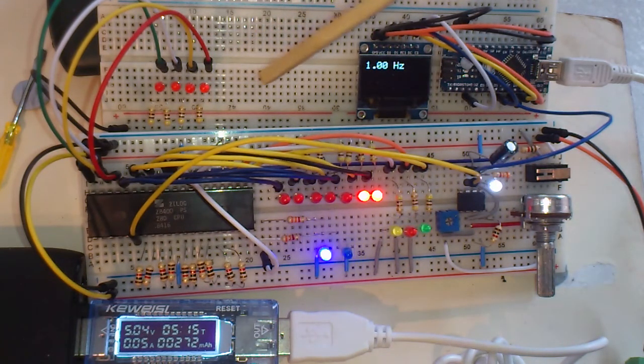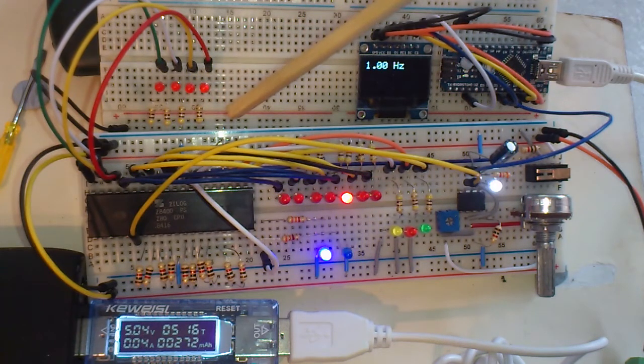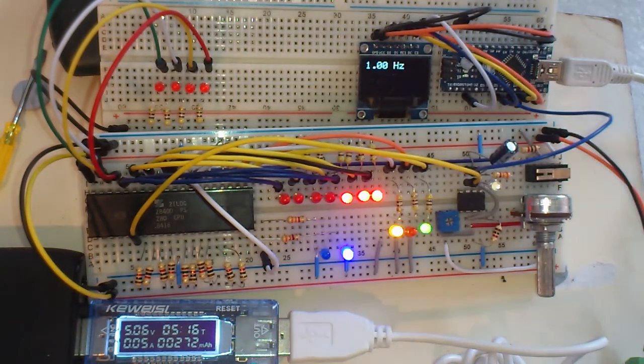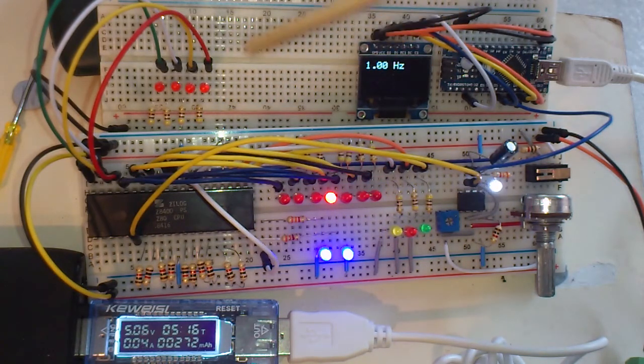The 5 external request pins. Yeah, there's the reset, the wait pin. So some external devices will want the CPU to wait before executing the next opcode until some task was completed. And the bus request. Again, you might have some external device requiring some bus request. So we don't want these becoming active.